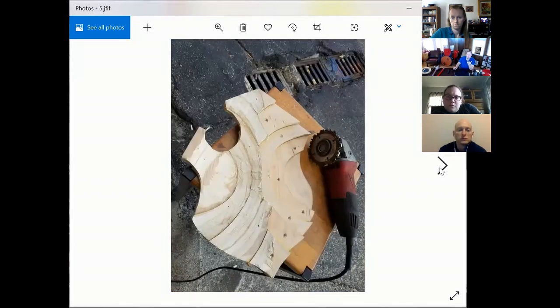And that's exactly what I started doing here. I'm using a chainsaw disc on an angle grinder. That's an Excalibur disc. And I have the scars from it. So I don't recommend using a chainsaw disc, even though I still do. I recommend using an abrasive disc. There are abrasive discs from the same guys who make these chainsaw discs that have little spikes, like a giant spinning rasp, and that's much better for this.